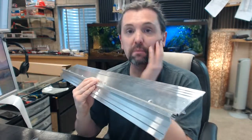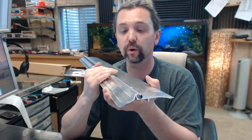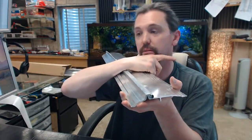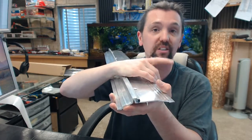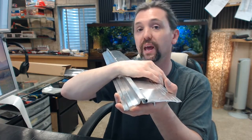National Guard, their name is synonymous with commercial weather stripping, and if you are in the business of making a living installing doors and hardware, by all means familiarize yourself with the National Guard line. It's not only thresholds and door sweeps and perimeter gasketing. Material made of aluminum like this, stainless steel, architectural bronze. And they also have a comprehensive offering of steel vision frames for use in wood and metal doors.